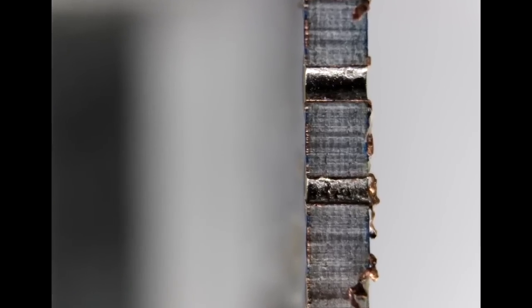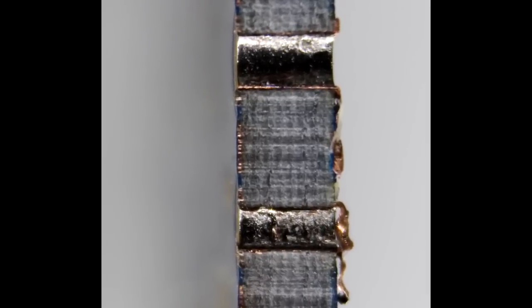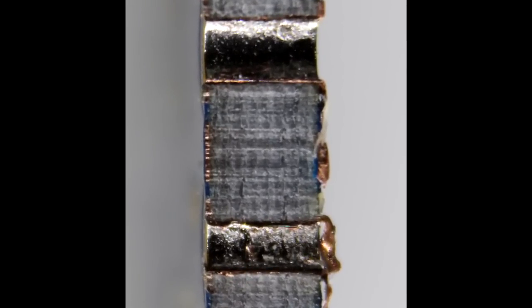This is a ground edge of the circuit board and you can see a couple of vias there. It gives a first sense of the aspect ratio — that's one important characteristic of circuit boards: the diameter of the smallest via compared to the thickness of the board. What we're looking at here is a very commercially obtainable, inexpensive process. As you get into really thick multi-layer boards, that aspect ratio can get incredibly thin, but not in this case.